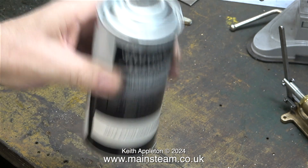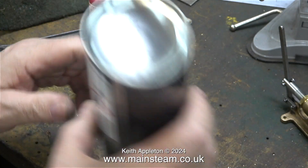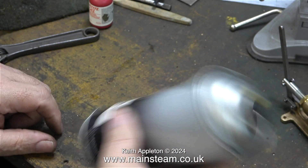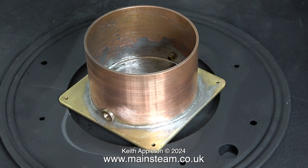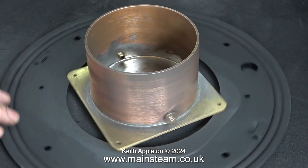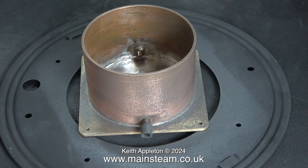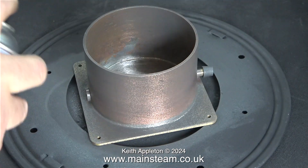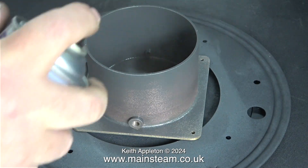It's time to rattle the rattle can. This is very important: when you use these cans, the agitator ball is only in there to do one thing, and that's to mix the paint to the correct consistency. While still shaking the can, I'm now in the outer part of the workshop and let the spraying begin. When spraying using these rattle cans, I find the best way is to apply several thin coats and keep going round and applying the paint until everything is covered.